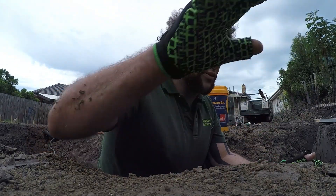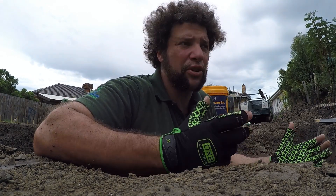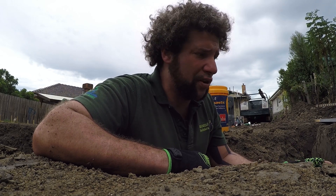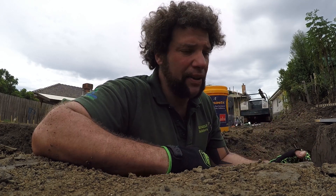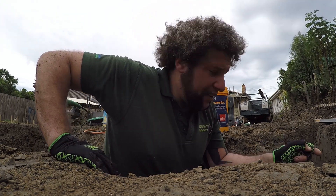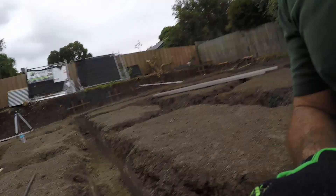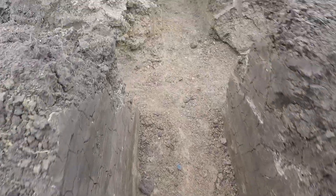We need to go a little bit deeper, or we need to do massive strip footings like we've done here, and then that all gets tied in together so if anything moves, the whole thing moves as one. Another option is piers — they'd probably need to be 450 to 600mm round diameter and 1600 to 1800mm deep. But just over here, only two steps away, we've got perfect clay, which is absolutely spot on.